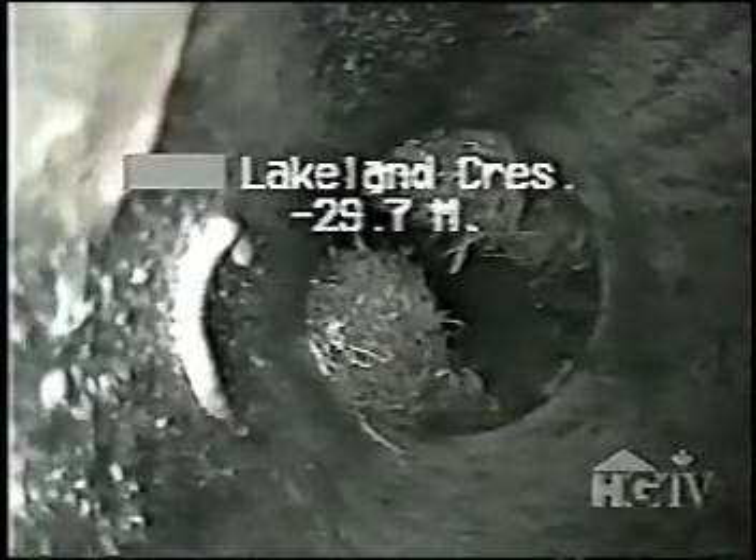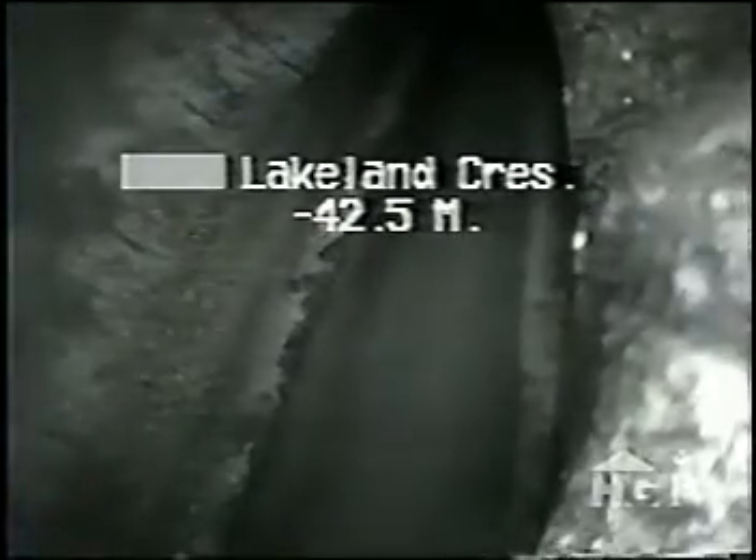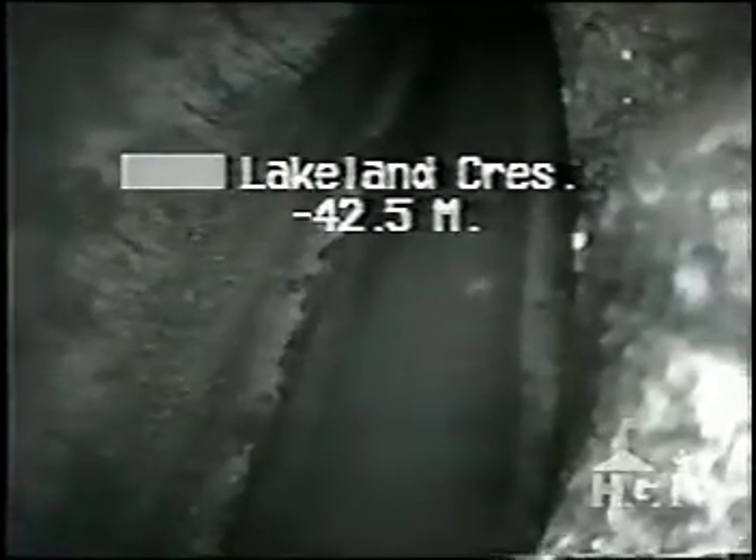Let's take a look at a real video. You can record video while you're doing this and see exactly what is in a real sewer line. This is kind of yucky stuff to watch, but you can identify exactly what the problem is. This video shows tree root penetration coming into the system, and that tree root is interfering with the flow of water. And here we're already out to the main line sewer in the street. So you were able to identify exactly where the roots were and exactly how big the problem was.